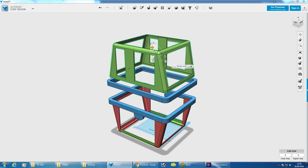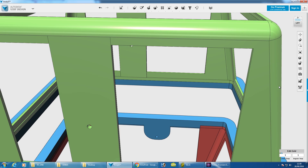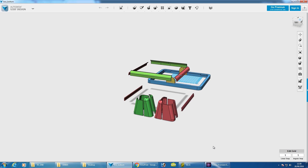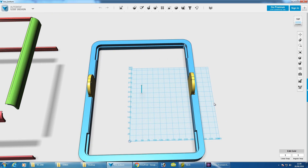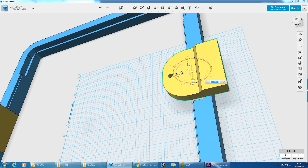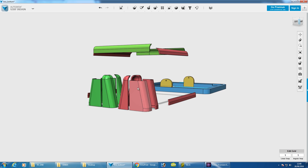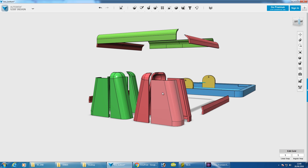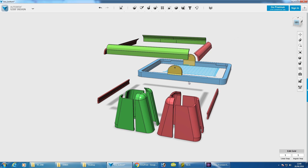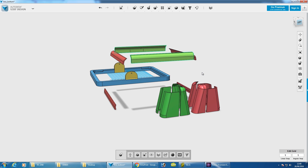The inner frame will lift out and slot neatly into its skirt, so we can lie some of these parts flat. The corners I want to print that way up for the best print quality. I've cut the bottom frame into several pieces — the tabs are removable, printed flat on the bed for strength since they're the main mounting points, and will be solvent welded in. The corners have been broken down because they're otherwise too tall for the printer. I'll likely need some extra reinforcement tabs on the inside where the long pieces attach to the ends.